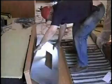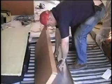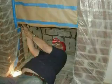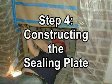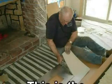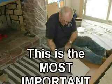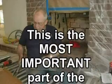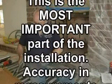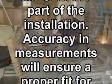I will take and cut that, and I usually trim 1/4 inch off the sides, like 3/4 inch off the back if the back of the fireplace is angled. If your fireplace is stone, you will have to trim the front side of the ceiling plate, so it will be only 1 inch or 2 back from the front of the opening. I will then take and try to fit the ceiling plate up inside and see how close I am. I might have to do some additional trimming.